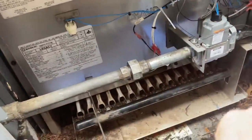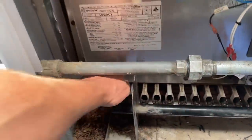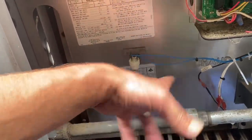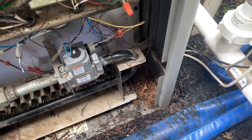One of the common service and maintenance issues I see with pool heaters is cobwebs or little debris that grows right in the orifice — I just take a piece of wire and shove it in there. Since they were talking about something burning down, I want to keep my hand around here and make sure there's no excessive heat where it shouldn't be. We have a rollout switch right there — it's a thermodisc. Once it reaches a certain temperature it burns out and you have to replace it. I see a lot of rollout issues with Raypaks — it actually says on the display 'rollout switch open.' I'm also going to advise them they need to clean this out. Look at all this debris — they need full maintenance on this unit. That's a fire hazard.